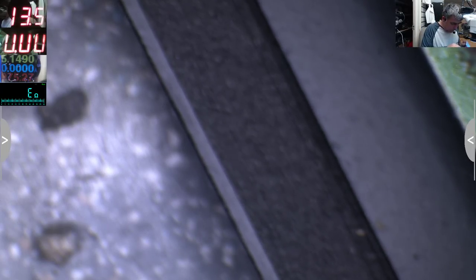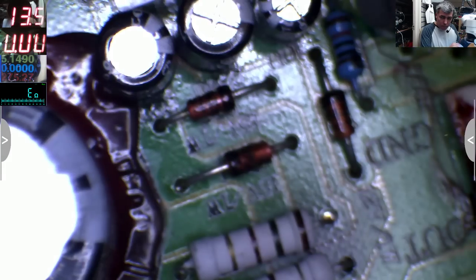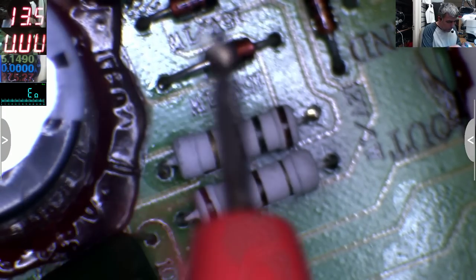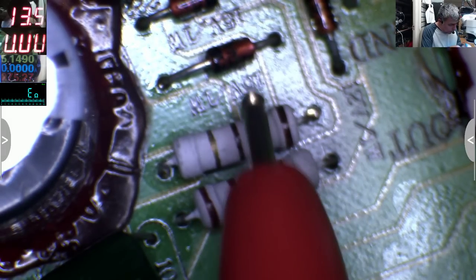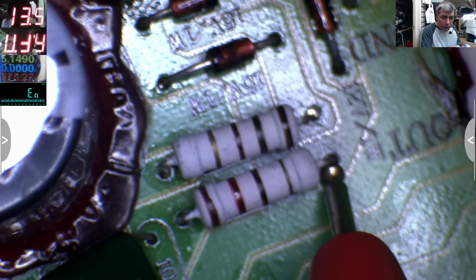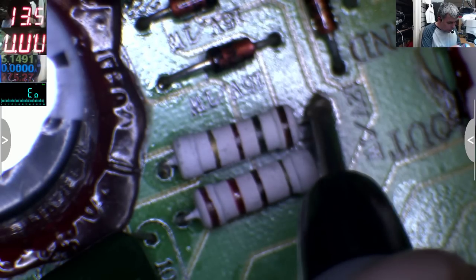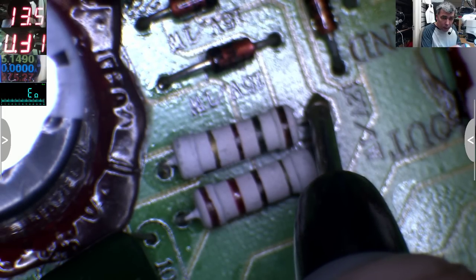You know what? Let's come with a power supply. Set up, not 15. Let's say 13. Okay. Ground. Can't see there, and here we plus, yeah, and it's okay, it's taking like 300 milliamps, it's fine. Let's switch, well, let's come here, and it's okay, 300 milliamps.